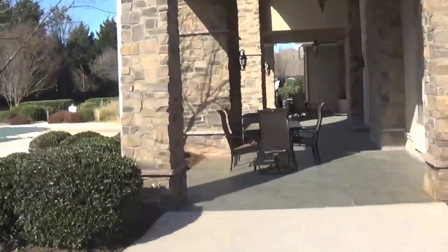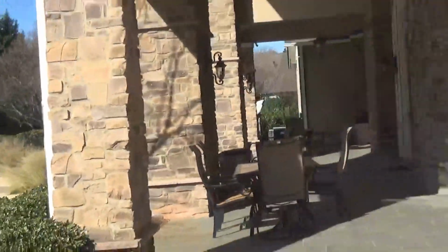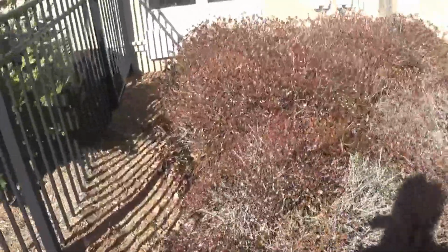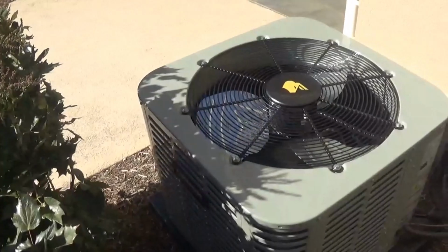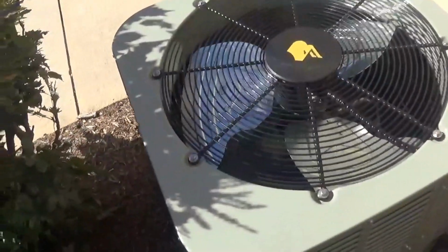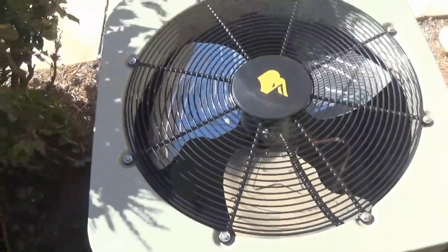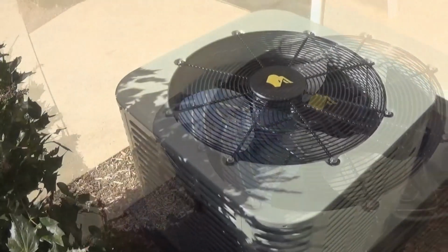And there are the other two units down there. Got to start with one of those last summer. Now I think this does one of the office rooms, because I saw a thermostat right behind that door, and I'm pretty sure that's what this unit does. Though the room is pretty small, and this is a 3-ton system, and I don't think 36,000 BTUs are required to cool a room of that size.